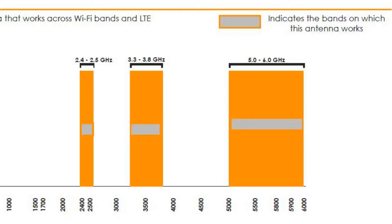The antenna itself covers the 2.4 GHz band, it covers the 3.5 GHz which is not a free Wi-Fi band but often used, and it covers 5 GHz. So it's an antenna covering all of those bands simultaneously using one connector.